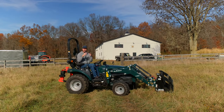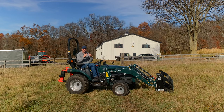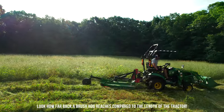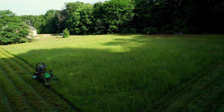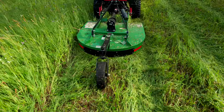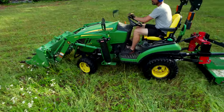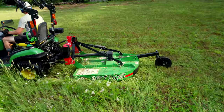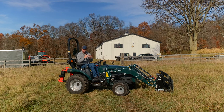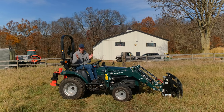Another option that can be good and bad depending on circumstances — sort of like how the cab was — is going to be an attachment on your three-point hitch. It depends what it is and where you're working. A lot of folks will say brush hog, and that is very good at putting as much weight as far back as you could possibly go. The downside is they tend to swing and sway and can throw your tractor around a bit, which is annoying if you're not actually brush hogging. Also, if you're working in confined spaces, you can potentially whack into something and cause damage. Of course there are smaller attachments like box blades and tillers too — it just depends what you're looking to do.